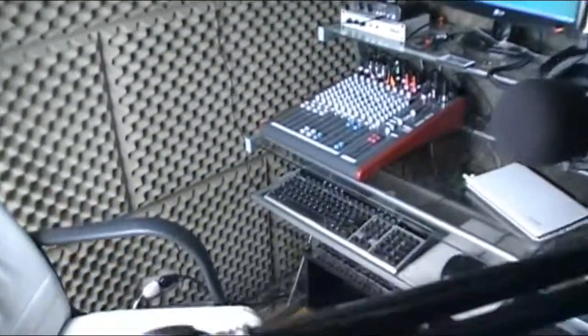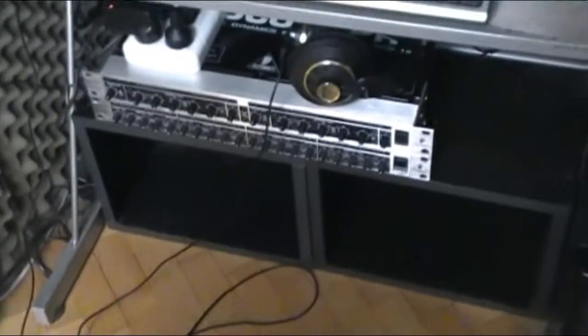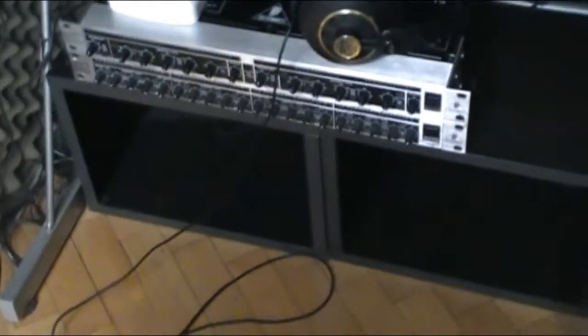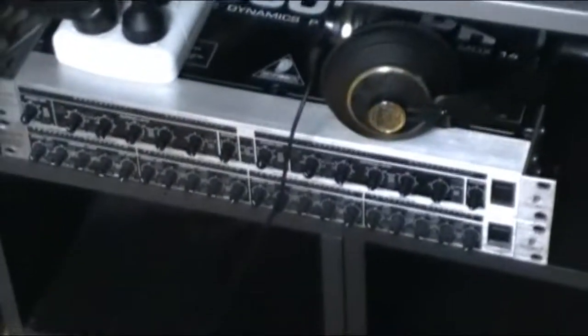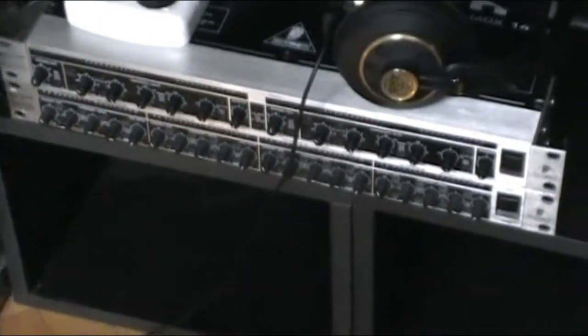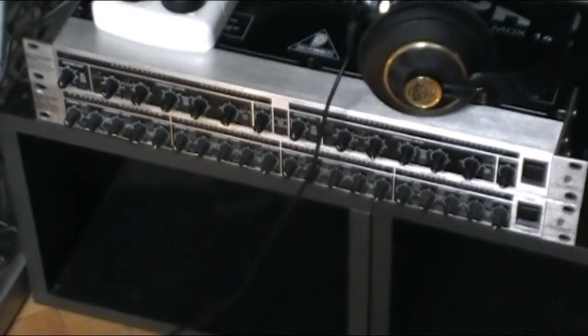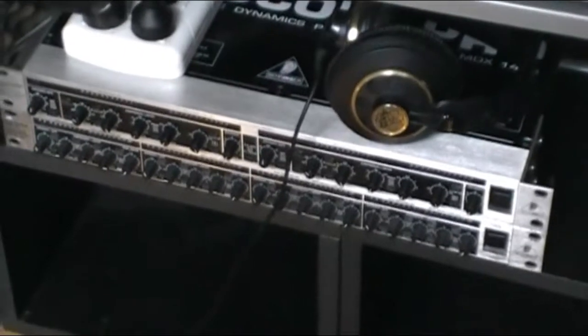So in this part of the studio, as I mentioned, nowadays I'm just doing radio. When you go live, you can't do as much post-producing because you're live. So I process my vocals and some music, and the telephone hybrid, as well as the Skype coming out from that netbook, in those pieces of compressor limiter gate. The one below is for the 4 microphones, and the one above is for compressing the phone and the Skype connections.